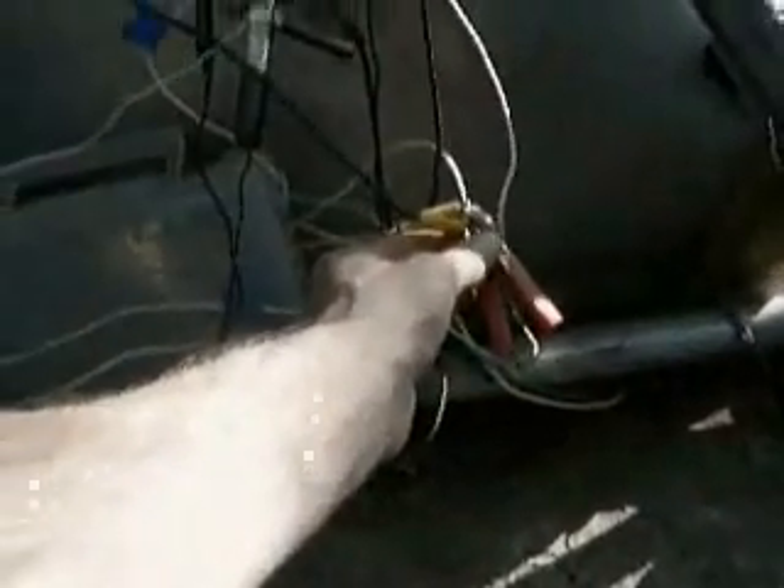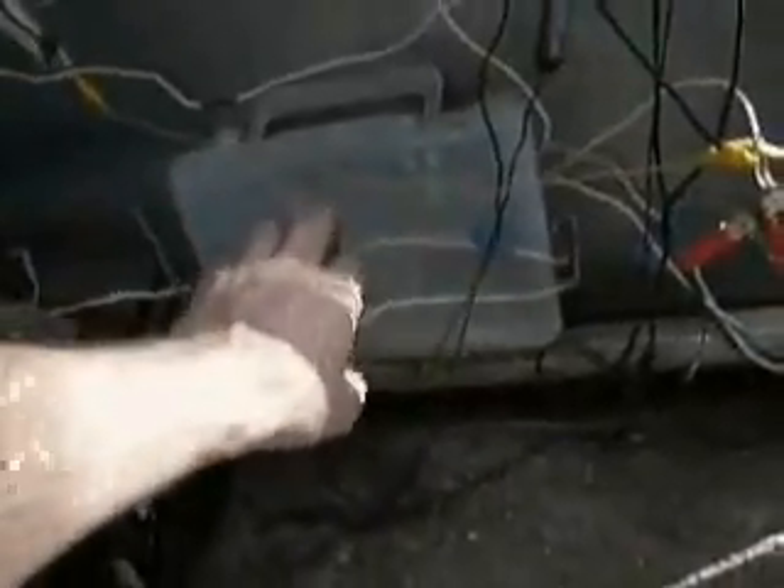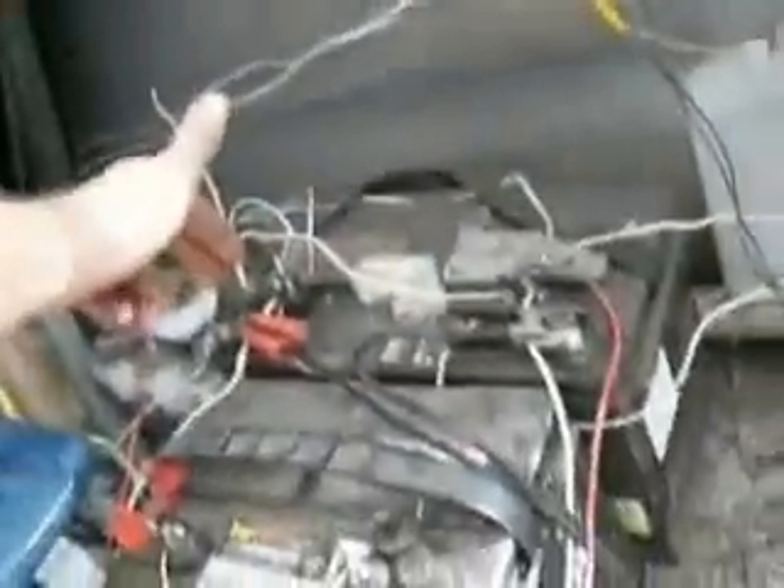This mess of wires — this is all the positive wires coming from solar panels, and this is all the negative wires coming from solar panels. The charge controller, which had some assembly required, has an input for the solar panels — a positive and a negative — and then it has a positive and negative output for the batteries. That's these two wires, so that goes to the negative and this other one goes to the positive, and then it magically works.